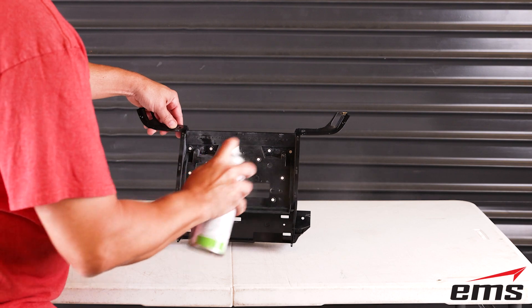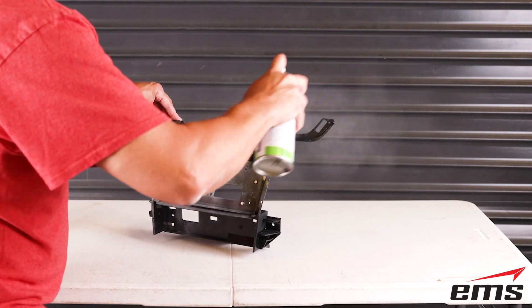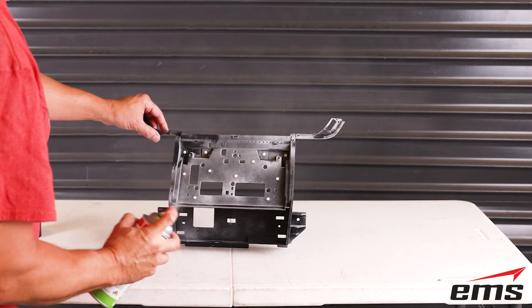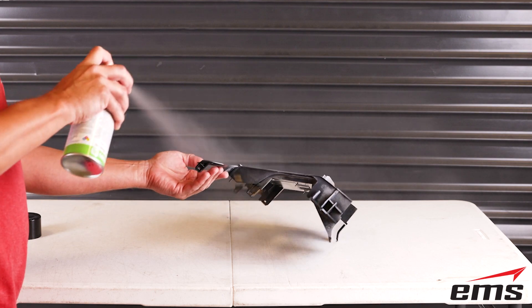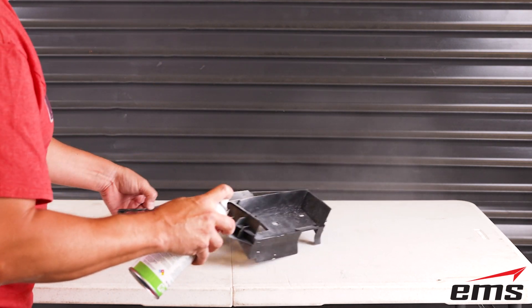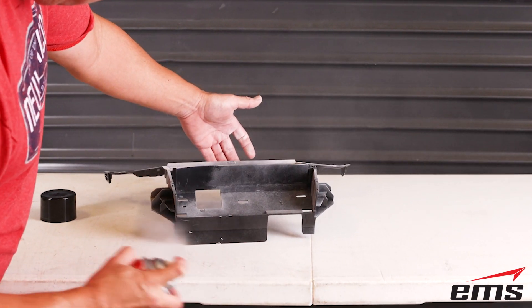So why don't we just use some sort of 3D scanning spray on these surfaces? Well, 3D scanning sprays can certainly help, but there are some issues with them as well. For example, sprays can be messy and create fallout when you use them — this means you need to go outside or spray in a well ventilated area. They are also flammable, which can be an issue depending on where you use them.